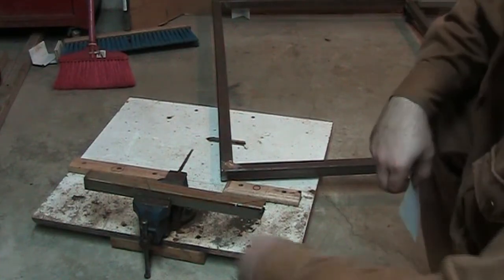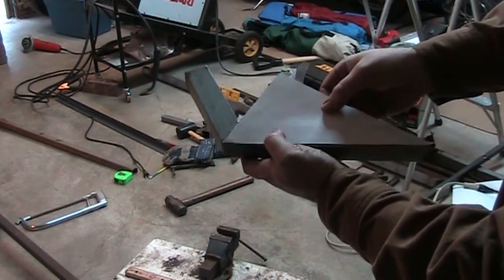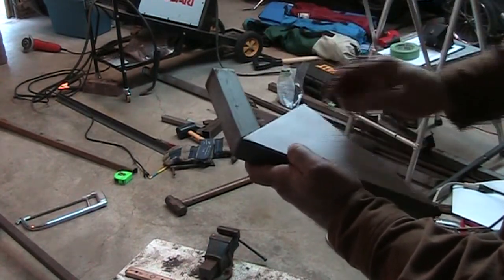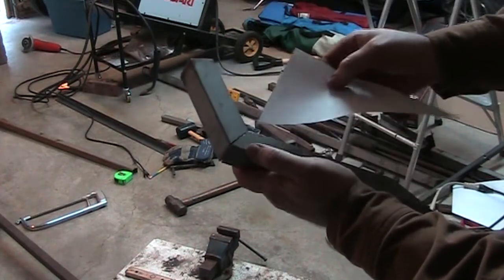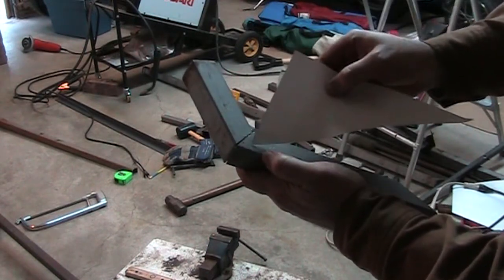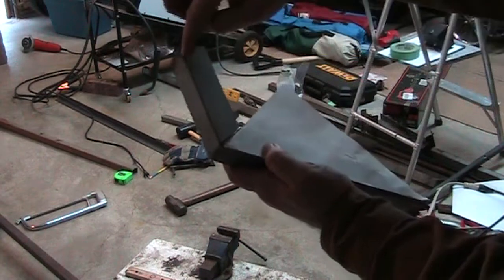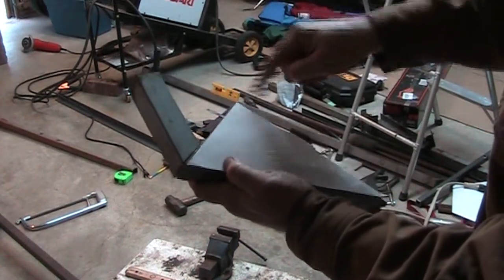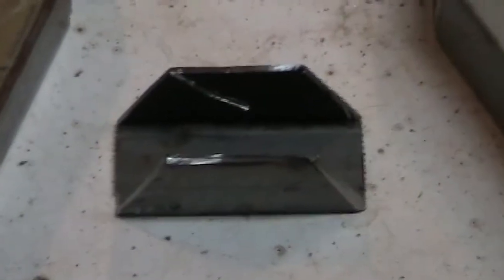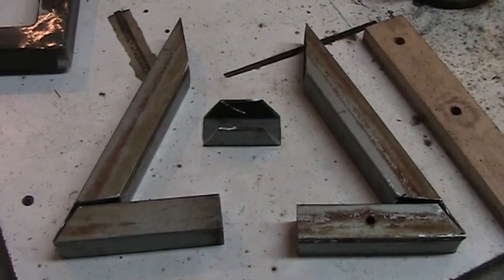I got the angle correct but it doesn't translate properly — this is still the exterior edge, so whatever this angle is, I need half of that angle. I need to cut a line here and here so I can bend this all the way. Live and learn — cut out one strategic chunk of metal and my brackets are now useful again.